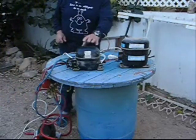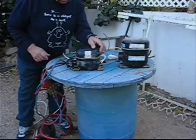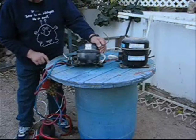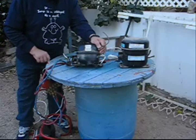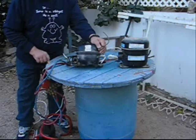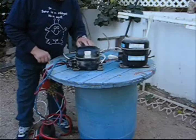Here's how to make your very own vacuum pump. This is a 1/4 horsepower compressor. It was seized when it was removed. I flushed it with WD-40, changed the oil with 3GS, which is the standard refrigeration oil — quite acceptable for a vacuum pump. It doesn't really matter if it happened to be on ester, synthetic oil, or otherwise.